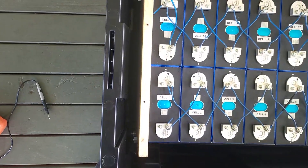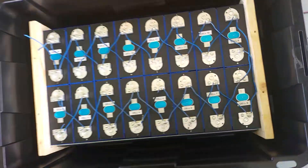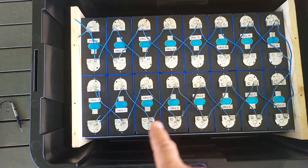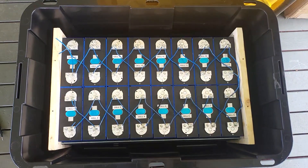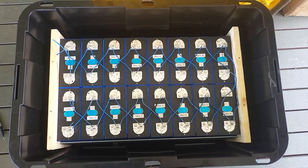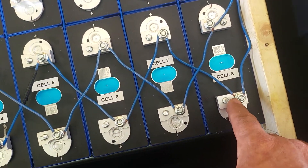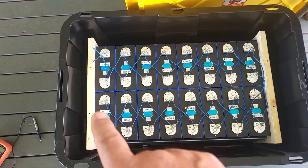It's in there pretty snug — all the bolts are torqued down and it fits very well. The battery is arranged in a cross pattern: I'm going positive to positive all the way around, then negative all the way around. I wanted to build the battery and leave it in its fixture rather than charge it in one straight row, top-balance it, then disassemble and reassemble. So I've just got the wire touching the terminal exposed and I'm going to do a top balance from here.